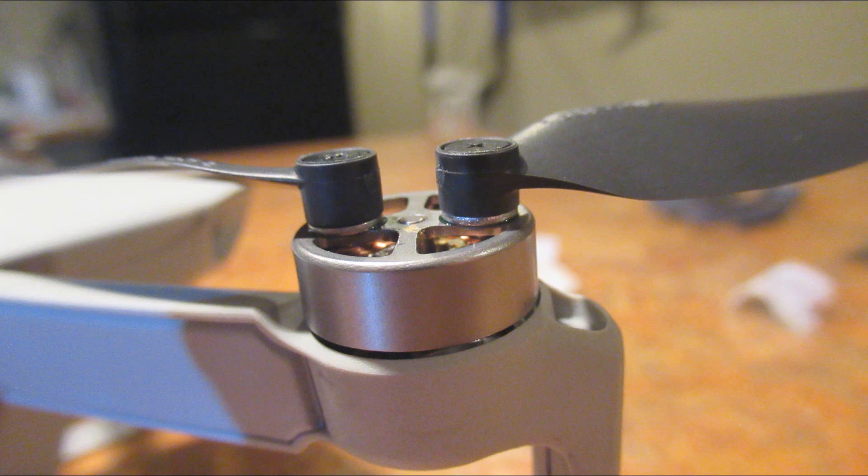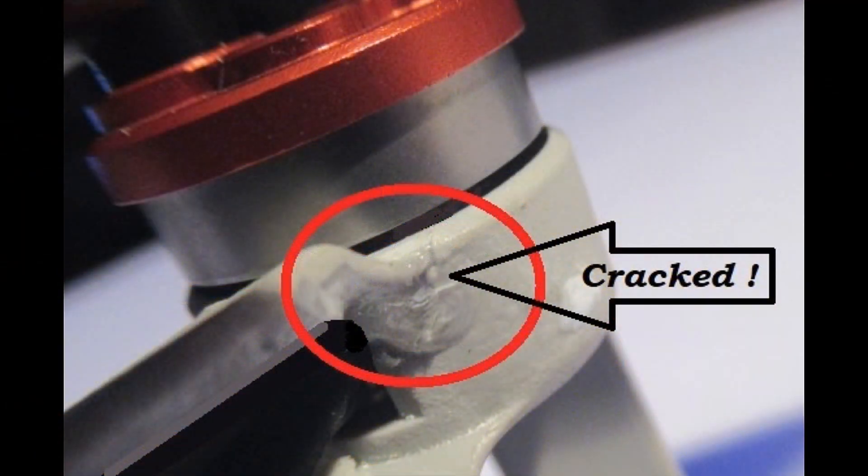I bought this drone on eBay. I asked the guy all about it before purchasing it, and he said it didn't have much time to use, but it did all the things it was supposed to do. I still hadn't spotted any physical problems with it, but there was. The left front prop was hitting more, but when I pulled out the flexible foam to do the arm stiffening, I found it was the right front arm that was cracked. I dropped in Satellite City's pro-grade hot stuff CA.